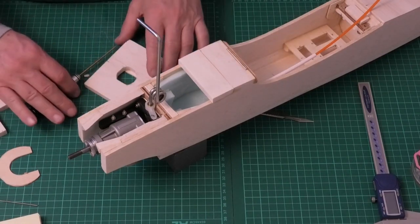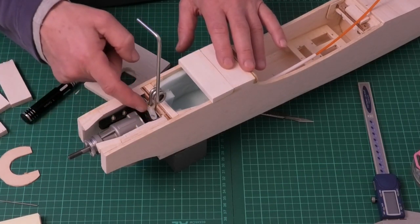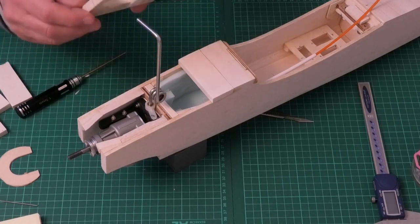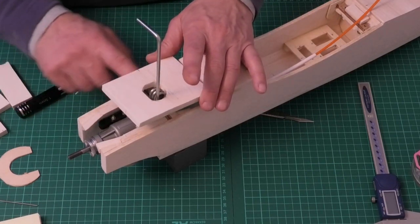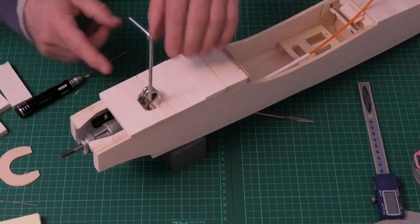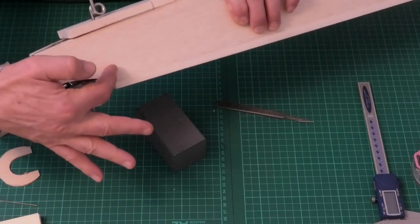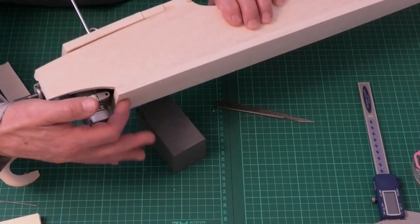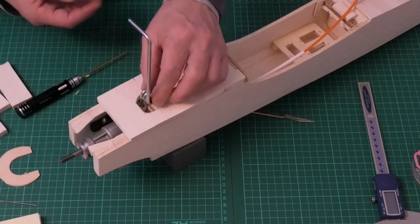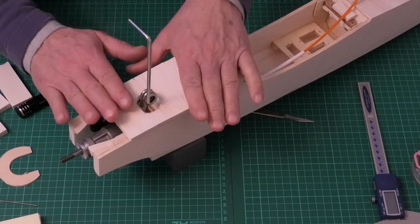I'm now totally happy I can get access to everything I need - tightening the bolts, getting the steering arm in, coupling it up, and getting the leg in. I've run through all of that and I'm confident I can do it once it's sheeted. One thing I need to mention: the steering leg is still a little bit too high because the part that goes into the mount is too long - it's just touching the balsa on the top. I'm going to trim that so it sits down about five to ten millimetres, and that spring will disappear into the recess.